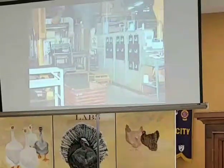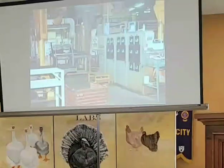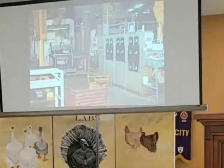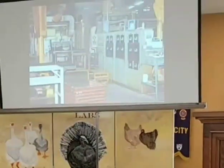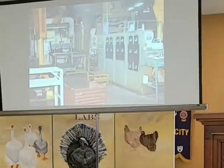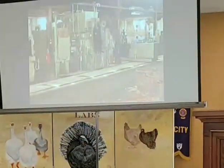This was the control area. About every 10 minutes they would load a tray with 10 to 15 parts and push it into the furnace, and another tray would come out. Each blue box is a controller for a separate zone — heating up to a certain temperature, maintaining it, then going through a quench series. It was very complicated. Once in a while there'd be a part pile-up inside and we'd have to shut the whole thing down, wait a couple days, and crawl in to see what the problem was.